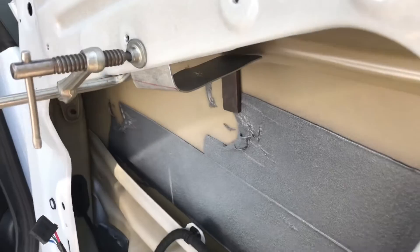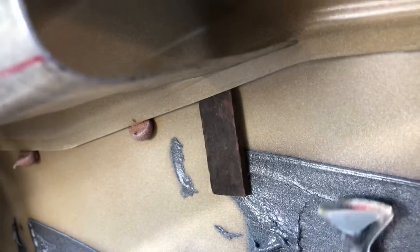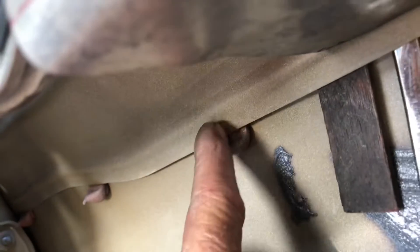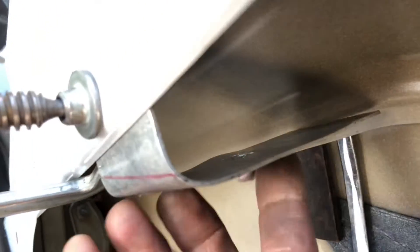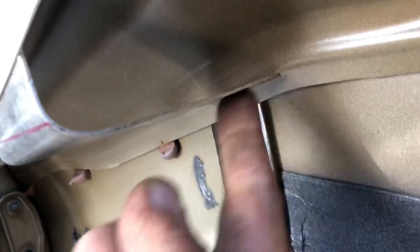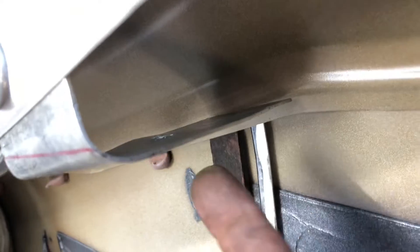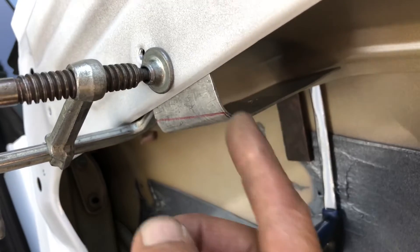Here's my solution when working up inside the brace. I put a wedge right here so I can have a little bit of a gap — the proper gap for tools to go up inside. When you're twisting out, you don't want to damage the brace or put a big bend in it. So I put a piece of metal and bent it to where I was able to support the brace — so if it's going one way, this piece of metal prevents it from going that way and blowing out the brace. Pretty easy setup: just get a clamp, a piece of metal, and bend it for the distance.